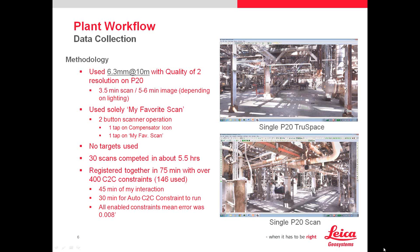Could you explain the scan image and how it looks like a photograph? Our scanners take two passes. First it collects every single scan measurement, then it takes a second pass and takes a series of images, which we call a MOCA image. When you import it into the software, the image is then projected onto the point cloud. Everywhere there is a measured point from the point cloud, it extracts the RGB value from the image and colorizes the point cloud, giving it that photorealistic look and feel of the scene.